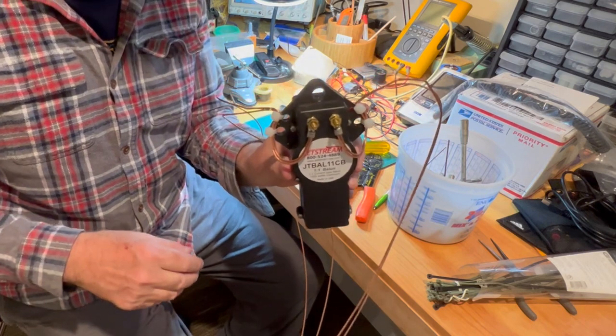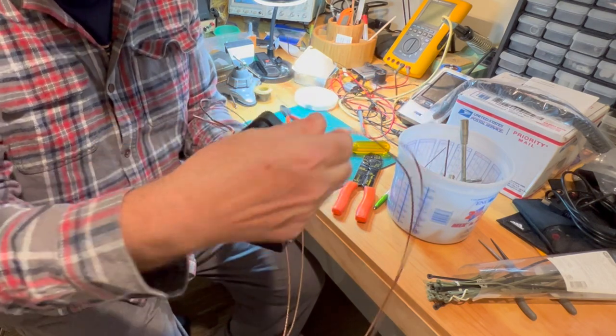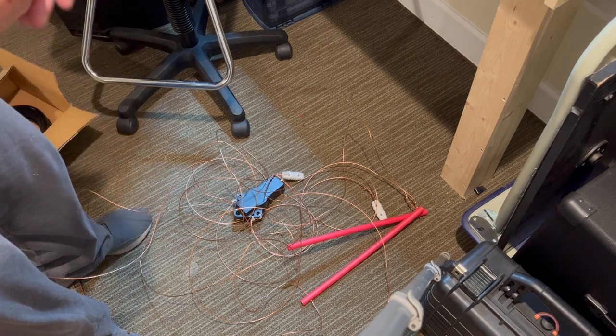Here's the finished product of the center. Both radials on each side, crimped and soldered, with lock washers holding everything in place and a couple of zip ties on each side. Things feel pretty firm. Next thing is to route this PEX, which is going to serve as a spacer, to keep the shorter 12-meter radial separate. Sometimes it's the simplest solutions that are the most elegant — I remembered I cut the radials about six inches longer than I needed, so I just wrapped it around the spacer and back on itself. The ceramic egg insulator works exactly the same way — run the wire through it, couple inches through, wrap it around and give it a twist. I'm not going to solder it yet, because I may have to make adjustments. Let's take this mess outside, unravel it, and see what we have.